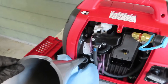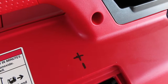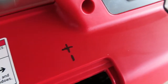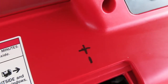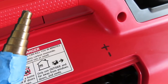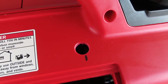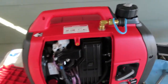Now we need to drill a hole for the propane line to come out — the scary part. The directions say three-quarters from here and five and three-quarters from there, drill a nine-sixteenths inch hole. I've got a step bit and it's marked. Let's see how it goes. All right, hole in one! It's done — doesn't really get much simpler.